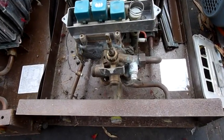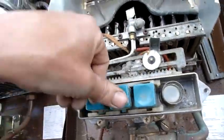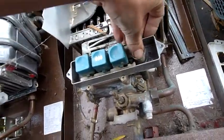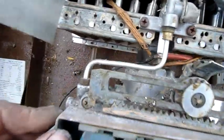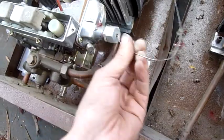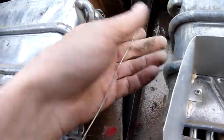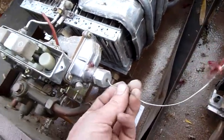I'll get one of these burner racks out and we'll do a proper autopsy on the table. Probably that one, since it hasn't had water going through it. This one looks like it's had water leak up into the block and everything — hence why some of this still works. But this is the worst one. You can see corrosion around the valve block. This one's in much better condition, and it has a temperature sender on the top of the heat exchanger as well.